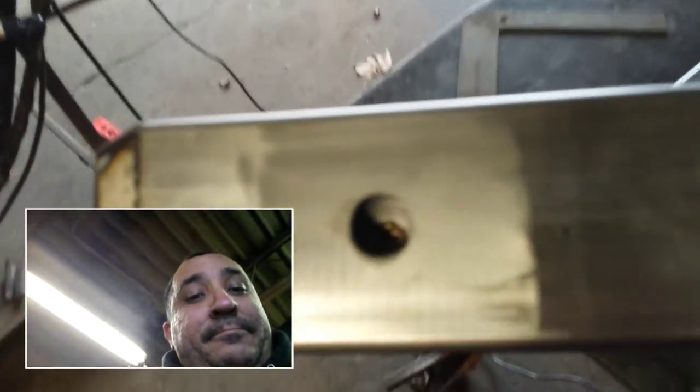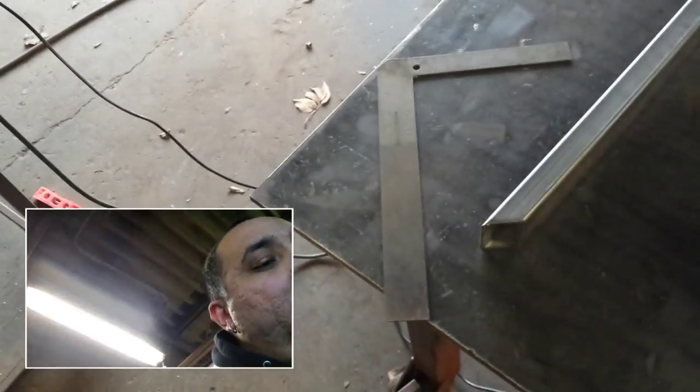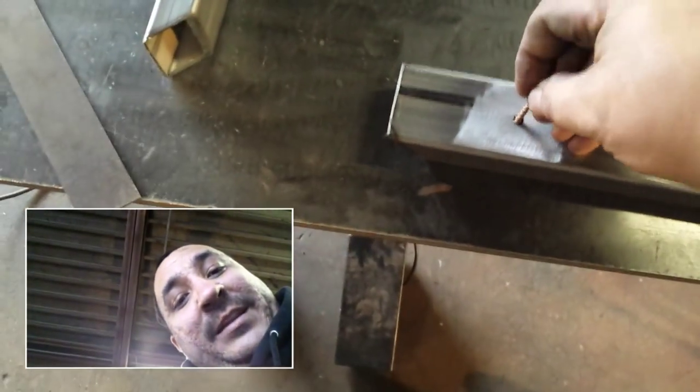You can plug the cap here, or put a cap plug right there, whatever you want to call those things. After you tighten it down, then you only have to deal with it squeezing one side of the tube, and you won't have to worry about it distorting the tubing. So that's why we're doing that. I'm not going to worry about that because I need 2 hands.